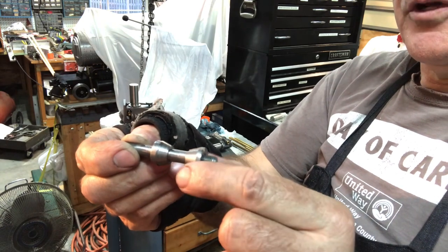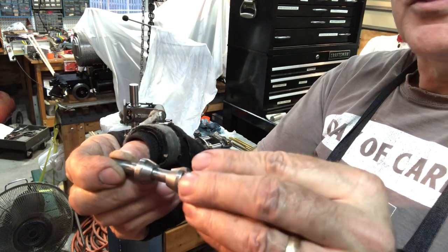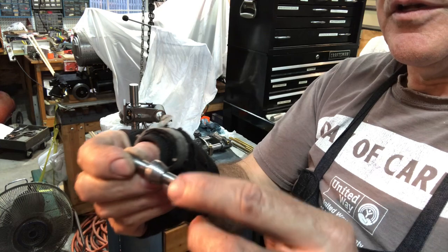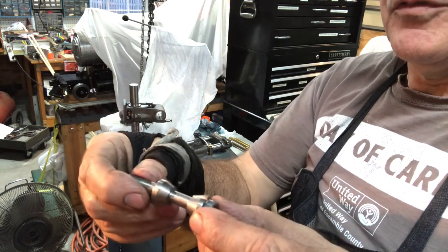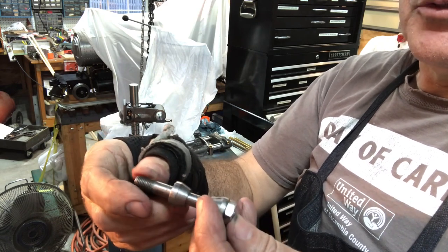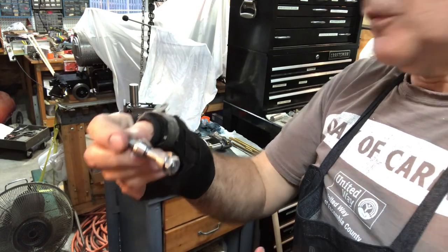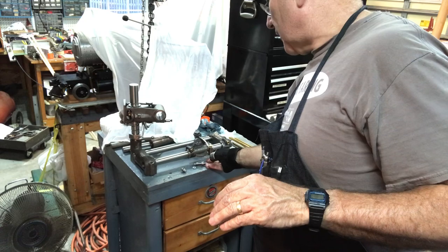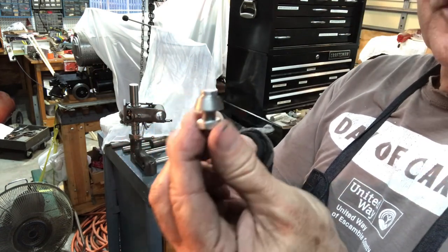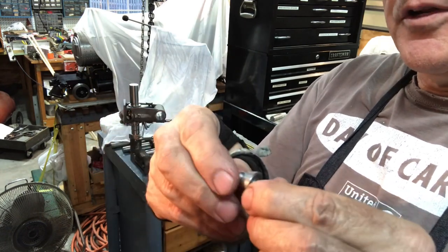The way this is designed, it's a lot less likely to twist when you tighten the tilting bracket. That's the beauty of this design - it was not hard to make. The next few video segments actually show the build process. The next things I'll be working on are the tilting bracket, and to machine it I also decided to make a little stub arbor with the 20-degree cone on it.